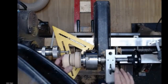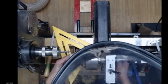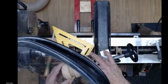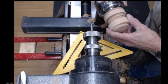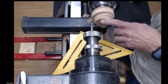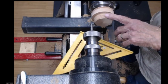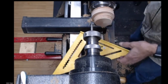Step number one. And what am I going to do? I'm just going to swing this out. It's a tiny bit too big. So at this point, there's two things I can do. I can turn it around again in the lathe and take some of these off and then re-thread it rather than trying to go deeper, or I'm just going to go deeper. Make another pass.